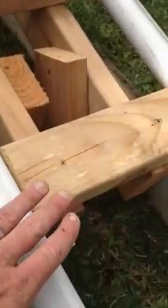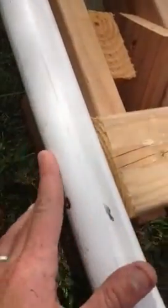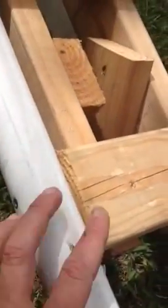Construction is very simple. Anyone can do this. You just get a bunch of 2x4s, cut them all the same length. In this case, I set them on my chop saw and they're all exactly 11 inches. Get some 3 inch good exterior grade screws. Counter sink them — that's really crucial. See how these are flush? Important. Sink them right into your 2x4. That's how you build the track.